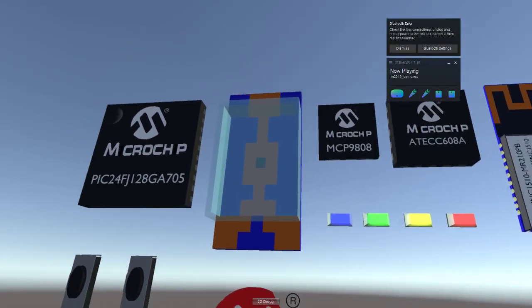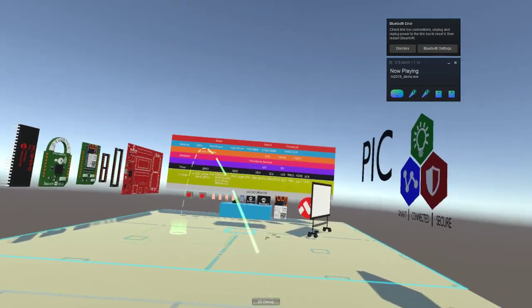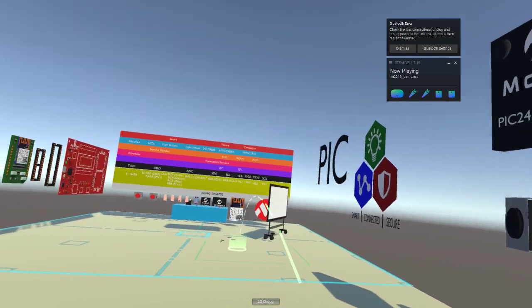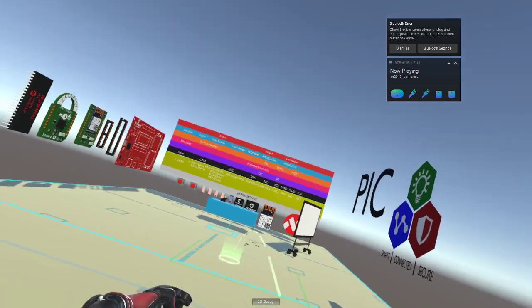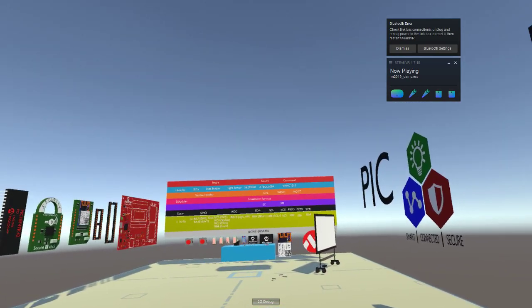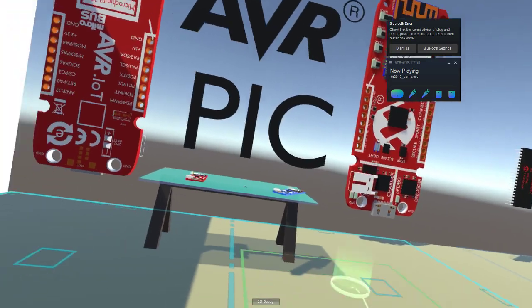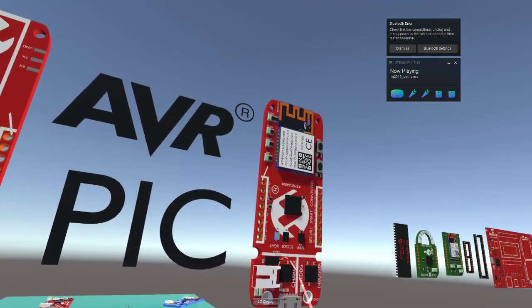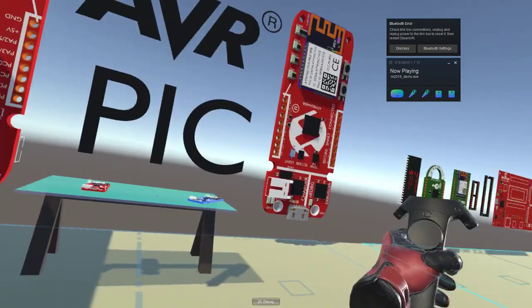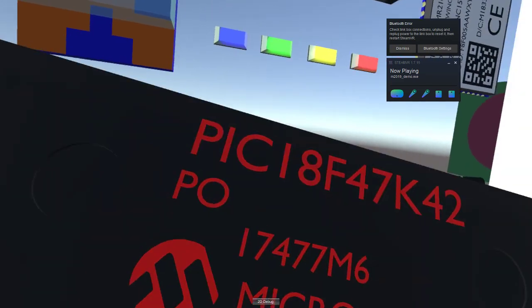So we can evolve it a little bit further, and we can say, well, we took everything from these components and we demonstrated all the development of the libraries. We did all the basic demonstration with that development board. We actually did it in Chandler. We did the MQTT library and all that using the HPC Curiosity board and PIC18 device. And then we ended up migrating into the final hardware solution in the end. So it's basically the idea of taking something from a prototyping environment and getting it to an end solution. We can walk everything through that.